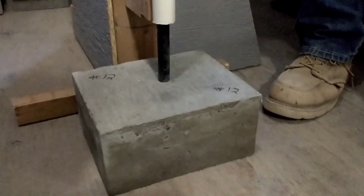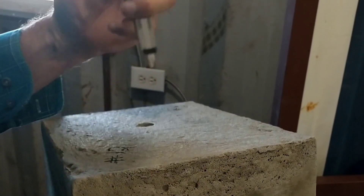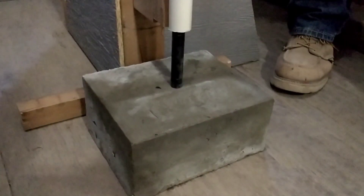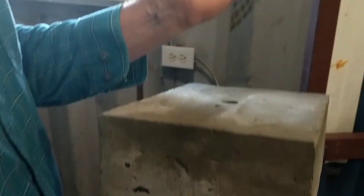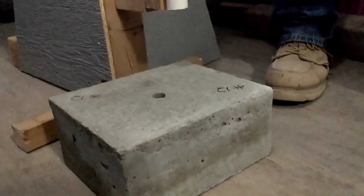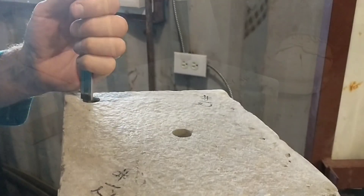For the chicken wire reinforced sample, the drop on the front was 0.55 inches deep or 14 millimeters, and on the back it was 0.78 inches deep or 19.8 millimeters. Again, I'm just shocked at how well this aircrete is absorbing the impact — it is not nearly as fragile or prone to cracking as I thought it would be.